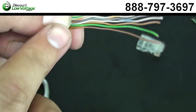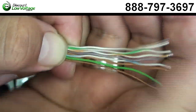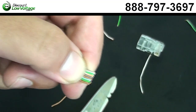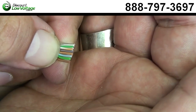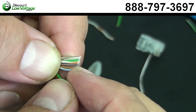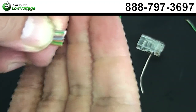So we got them sort of straightened out. You want to definitely double-check the color code at the bottom here towards your thumbnail and make sure you got the pinout straightened out. Now let's trim some of this off. I want to take a look at it and make sure the pairs are where they need to be — looks like we got an orange pair out of place, so we're going to go ahead and just kind of move the cable around a little bit.